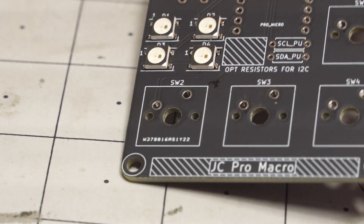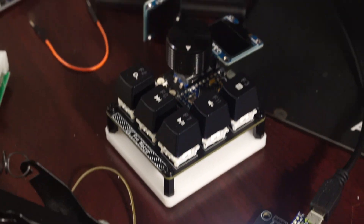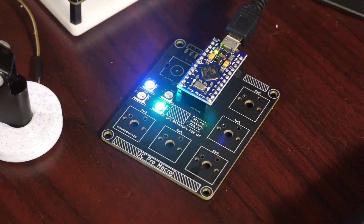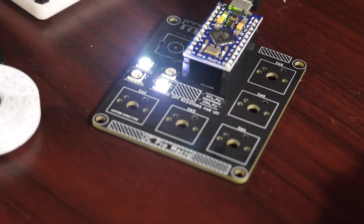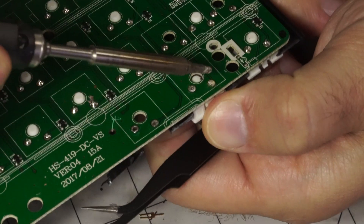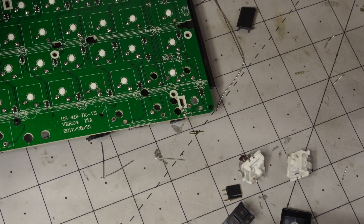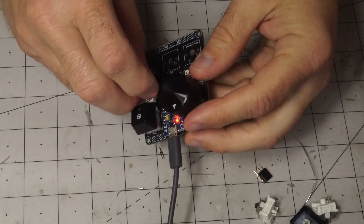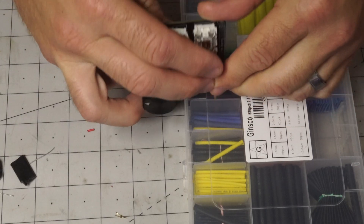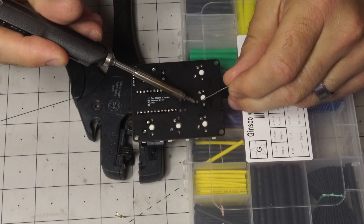Cooled off a little bit and then it was time to try it out — looking good! Look at those LEDs blinking every color of the rainbow. There's the finished part beside it. The little screen is optional, providing a different way of user interface if you so desire. As far as the keys, I ordered some, but before they arrived I plucked them off an unused keyboard. A little unsoldering, a little work with tweezers, and you're good to go. Just make sure you've got all the WS2812B LEDs installed beforehand, because modifying after the fact is a bit of a pain — ask me in the comments how I know.